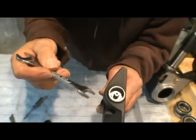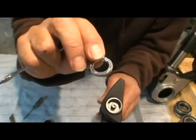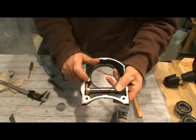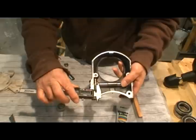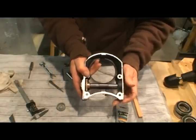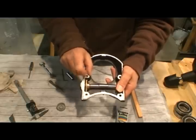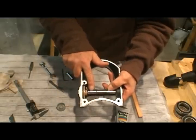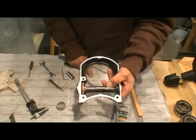You might have to make this tool unless you get lucky with a screwdriver, but I was afraid of hogging up those edges. Before moving the spur gear, measure the spacing between the gear and the edge so you can set it back at the right depth. Put it over the housing, check that the gears line up, and give it a spin to make sure it runs true. Mark the shaft where the flat side is so you know how to line up the set screw — Ed mentions that.